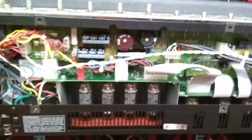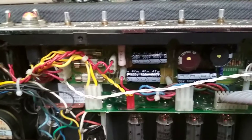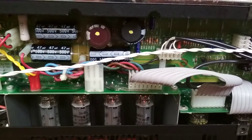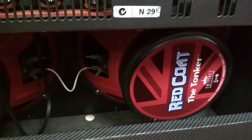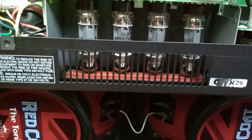Now it's these guys' turn — I'm going to change these two, put this amp back together and smoke it. New caps are back in, chassis back in, everything's back in. I haven't gone around to replacing the pots yet — I don't know when those will arrive as they're an odd size. But I just wanted to show you with the amp on. Power's on, it's on standby — I haven't flicked the high voltage over yet. The tubes are all glowing, preamp tubes are all glowing. Next thing is to flick the standby switch and see if it all goes up in smoke — which it won't because the caps are brand new. I'll give it a little play with the volume all the way down first because this thing has Eminence Red Coat speakers in a 2x12 cabinet. There's a lot of speaker there. I'm going to put the camera down and give it a try.